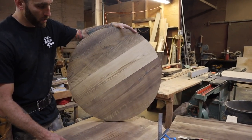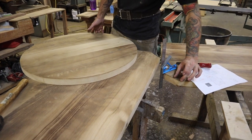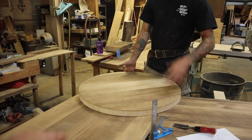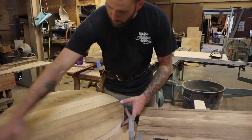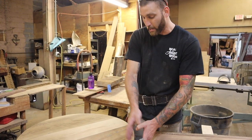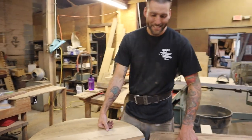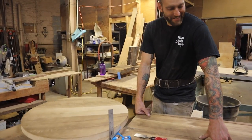So how's this countertop going to work? Two longer runs, we're going to be joined at about an inch and a quarter section here, and then we're going to be setting in this round top roughly right about there, and then it'll all be put together with dominoes on site. How are you making that cut? My thought was to take the router with a nice flush trim bit, make a jig out of some 13-ply Baltic birch — it's just a 30-inch diameter — then I'll add on that half inch for the diameter of the router bit and I should have the exact radius. I'll set that template on. I'm not looking forward to it, but it's got to be good. Can't go wrong with a flush cut bit.